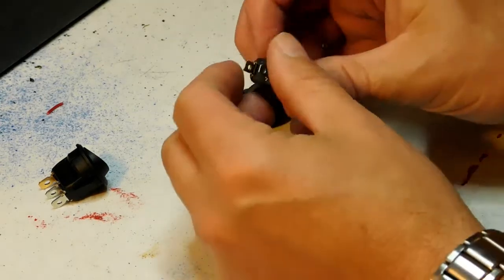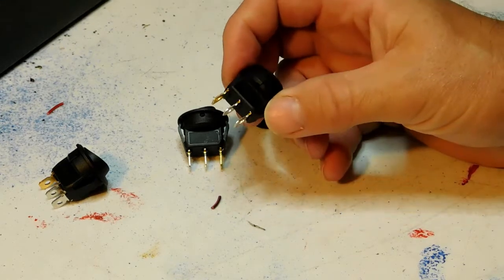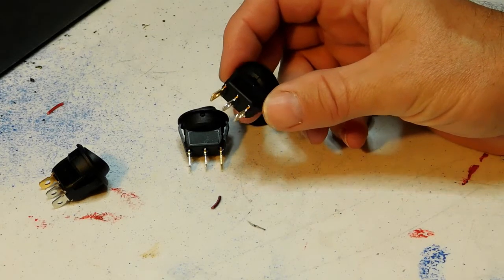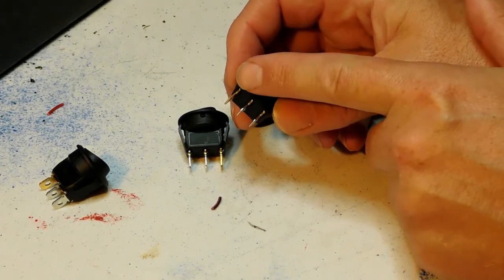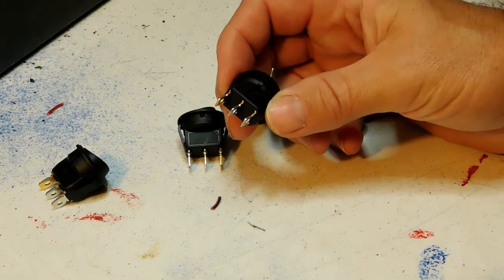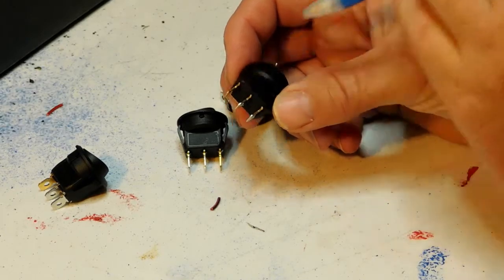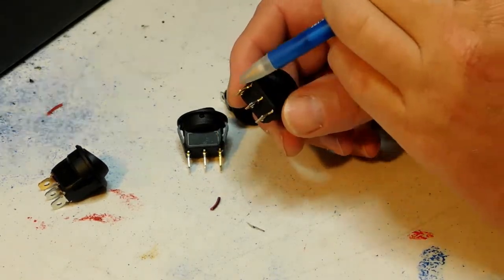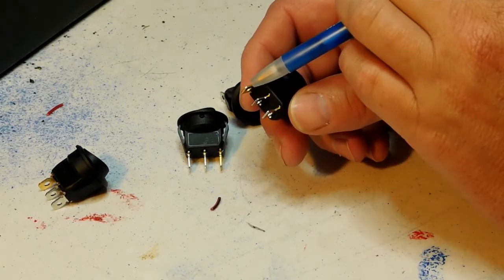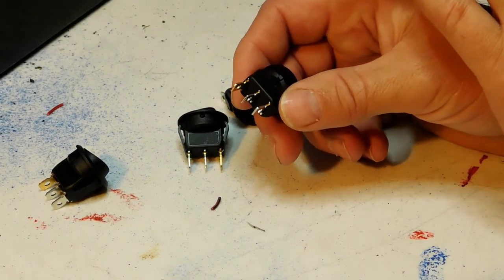I haven't seen purple yet, but they work really good. They've got three tabs on the back of these switches. I wanted to solve some of the mystery about how to hook these switches up if you decide to put them in your project. You have three terminals — one of them is brass and the other two are silver. The brass terminal is going to be your ground, because that's what's going to help light up the LED when you have a hot and a ground. I normally run a ground wire from the brass terminal back to the ground of the battery or power supply.